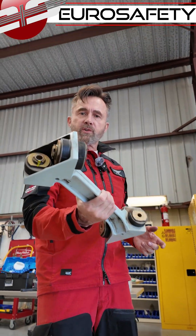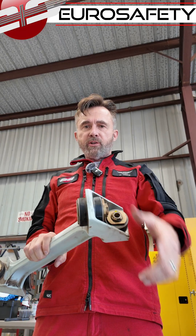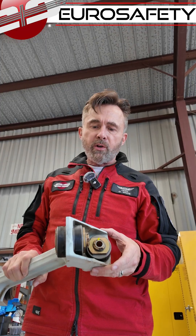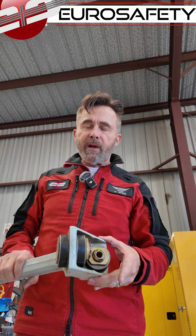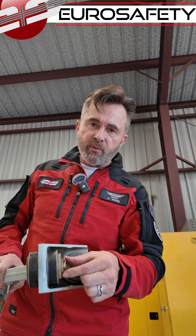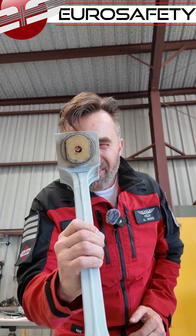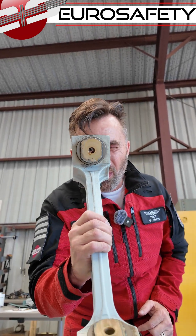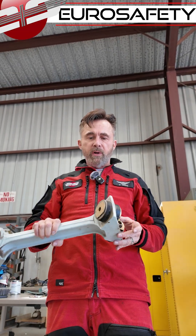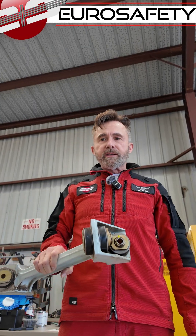One of my favorites — the dog bone. You'll notice that these laminated pads are attached to the bone itself. They're not secured to the dog bone by that bolt you'll see when it's installed on the helicopter; it's actually tightened down by this right here. And you can see there is actually a hole where the bolt goes through. On pre-flight, we want to look at these laminated pads and make sure that there's no bulging.